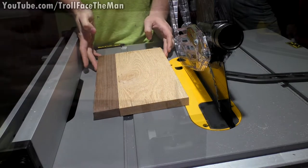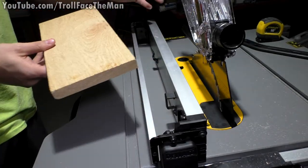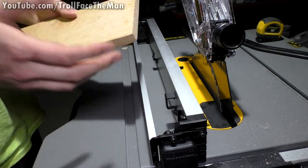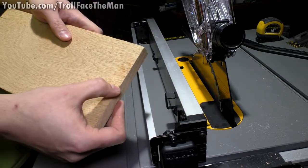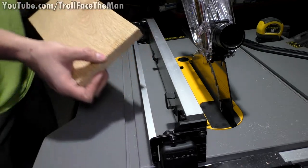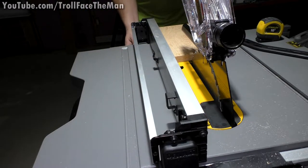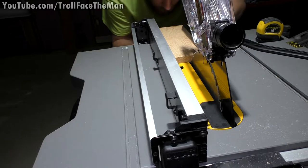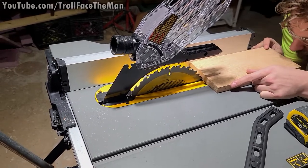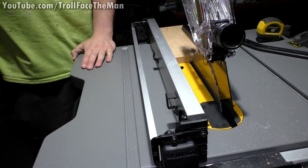That's pretty close. We want this cut as centered as possible, but taking into account blade width versus board side and tolerances can be tricky. On my dad's suggestion, I put a little black marker at exactly halfway in the board. I'm going to adjust to get that black marker as centered as possible with the blade, so the cut will be more or less center, then lock it and cut.